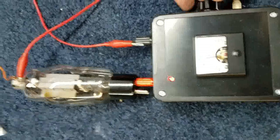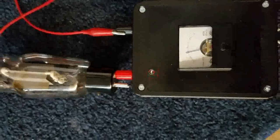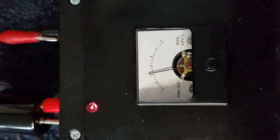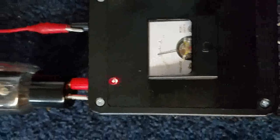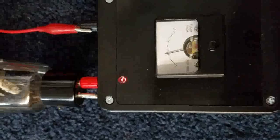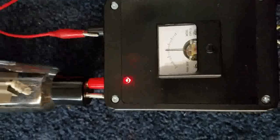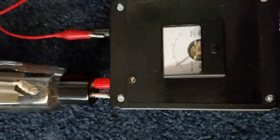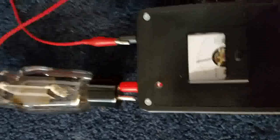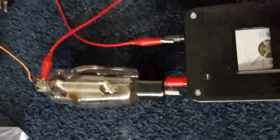It's going up. I should probably shut this light off. See the light starting? So this tube is starting to show leakage at about five thousand, five thousand two hundred volts or so, somewhere in there. And this thing will knock you on your behind.